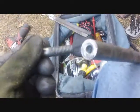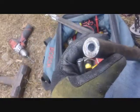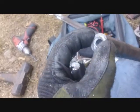Here's the end of the knee locking handle that I drove out before. Before I knew how to get this out, I was being a little too rough on the end. You can actually see I've peened this in a bit - so much so that now this doesn't even fit. I also think I enlarged this end right here, so the OD here is actually bigger than the OD further along. I want to clean this up - if I use a large drill bit I can cut that bad area out at the end, straighten it out, and then do a little work with my grinder on the outside edge to give it a chamfer. That way when the person goes to install this on their mill, they'll have a lot less trouble.